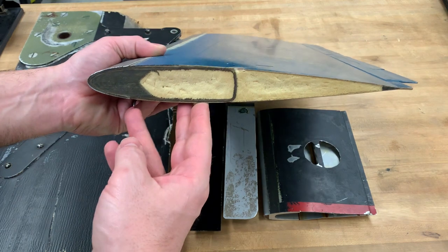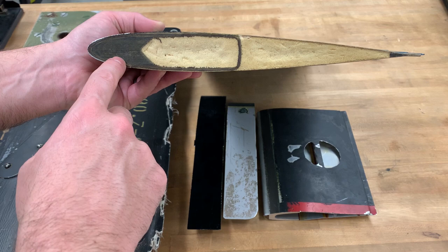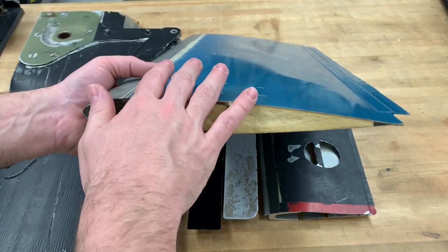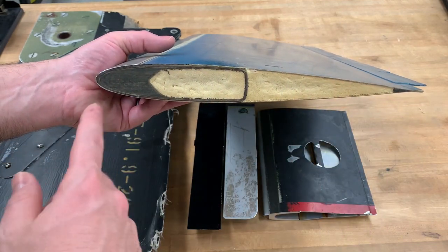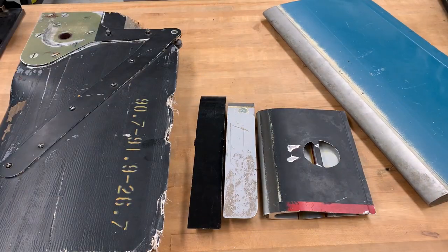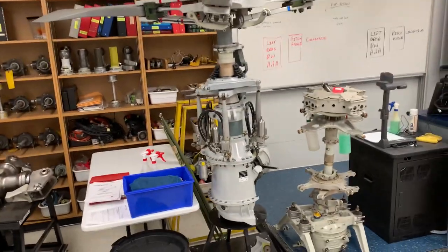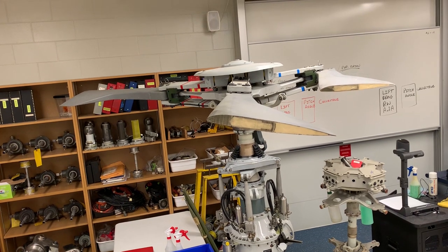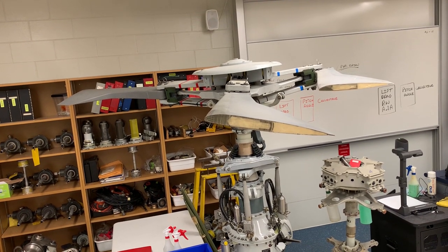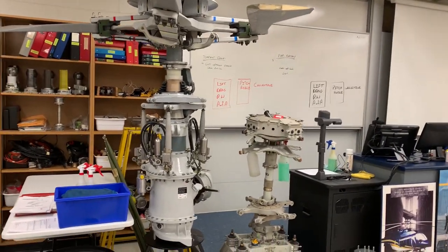This one here is a symmetrical airfoil. Just to give you a little bit of history, these are the blue blades from the A-Star — these are the older blades. When they came out with newer versions, they changed the profile of the blade. I've got one here that's cut, so I'll lift up the camera. As you can see, that blade is asymmetrical — that is the newer style main rotor blade on the A-Stars.